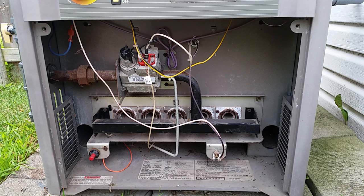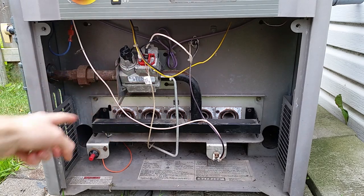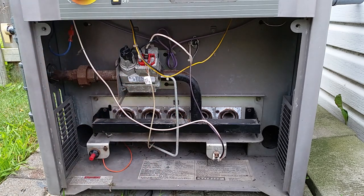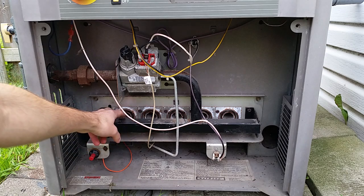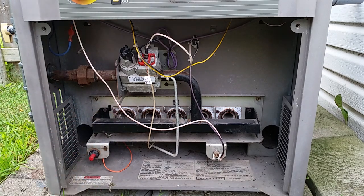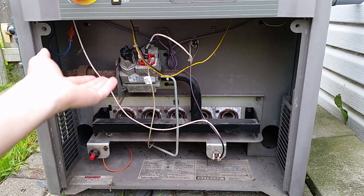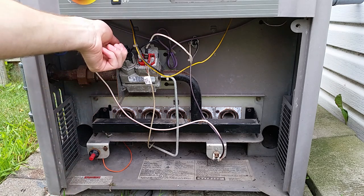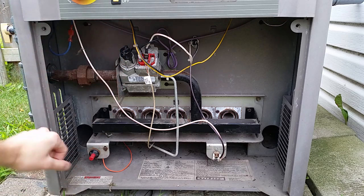These things are not that complicated. Over here is where the wire goes down to the thermopile. This is your gas tube for the pilot light itself, which goes down and under. When the pilot light is burning, you can see it through this little hole over there. There's not going to be fire over here where these little tubes are - that shoots the gas into the tube and the combustion happens way in there. So to light it, you turn this knob to pilot, you hold it down, and then you push the igniter.